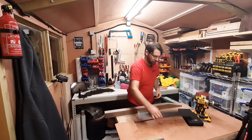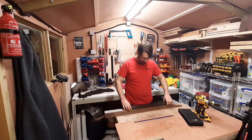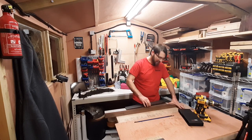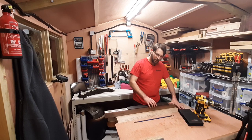All right, before I put the truss rod in, I want to see if it fits flush. If I seal up the truss rod hole and I place the fretboard down, I can feel a bit of back pressure from the air that can't escape between the fretboard and the neck, which means it's a fairly solid fit.